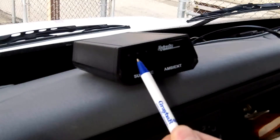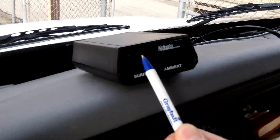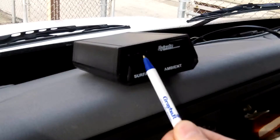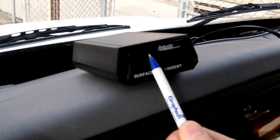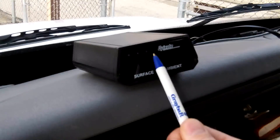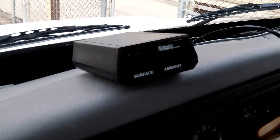If the menu zero button is pressed and held for a couple seconds you will enter the menu mode operation. If the increase button is pressed while in menu mode this increases the current modifiable value. If the decrease button is held this decreases the current modifiable value. When the display unit is in menu mode you may select an alarm mode, a sensor calibration offset, alter the brightness of the LED display, or if equipped specify an analog output range based on the temperature.